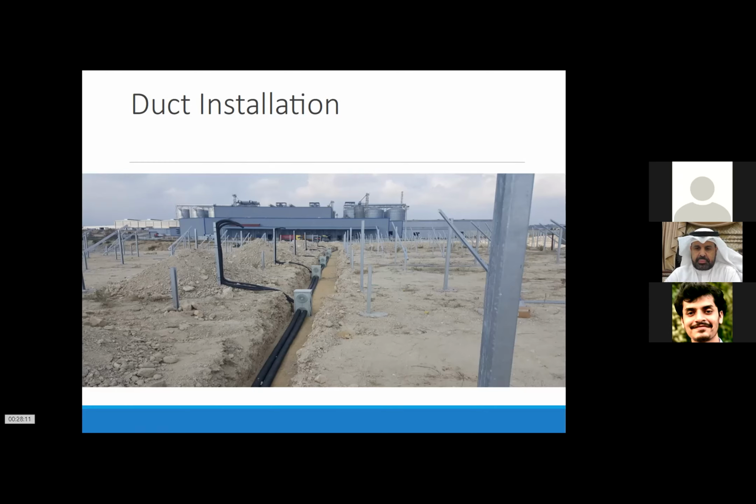with some settings. The problem is not the PV system doing its purpose. The problem is also that they sometimes already use capacitive banks. So I don't know exactly if you already use other capacitives in your facility. The interaction of these two is a little bit lagging. That means the existing structure of the industrial complex works slower than the one in inverter mode. So you can play with that and have a look. I actually made some systems in Pakistan with 0.85 and 0.9, and then they almost didn't use the original capacity bank anymore with the inverters.